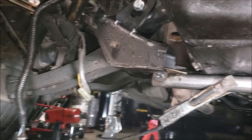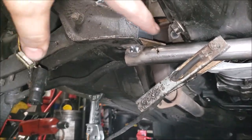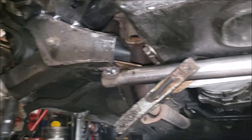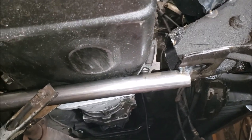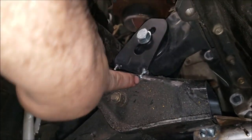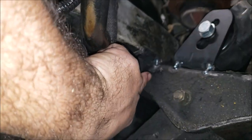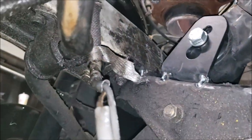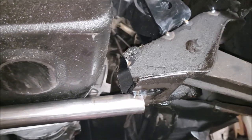We decided to move on to the next phase - welding the gussets while the crossmember is still attached is probably not the best idea. I went ahead and threw a little more weld on the bar on both sides and tacked the engine mounts right here. I also threw tacks on the factory welds - the factory welding on this crossmember is just a few spot welds holding it all together, and after us hacking it up like we did, I'm sure it was strong at one time but we need to reinforce it.